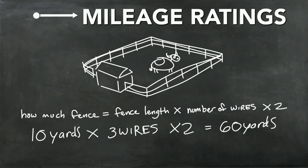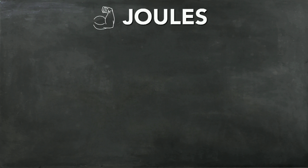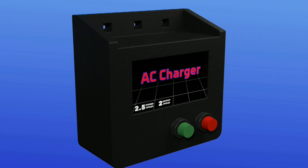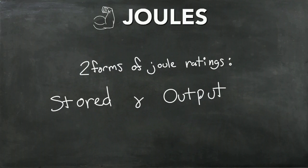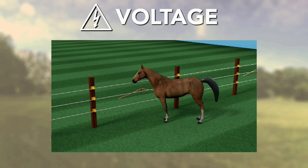It's the safest way to ensure there is enough voltage at all points on your fence. A joule is the measurement of energy used to rate low impedance chargers. Joule ratings come in two forms: stored joules and output joules. Stored joules will always be the higher number, as this is the amount of joules the charger has internally. Output joules is the actual measure of power that will be put out on your fence line, and therefore the only number that matters to your animals.